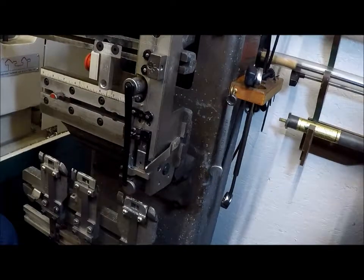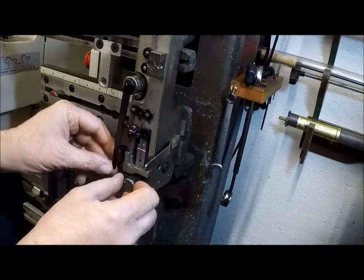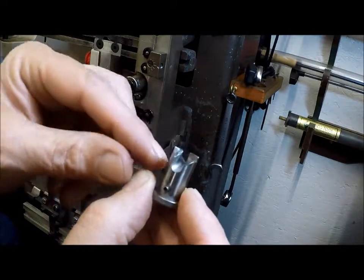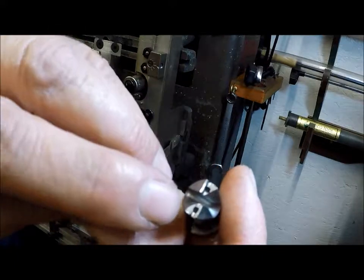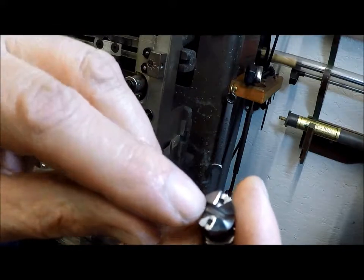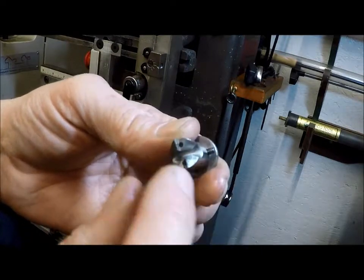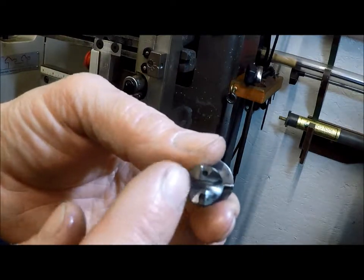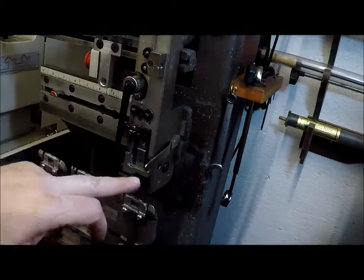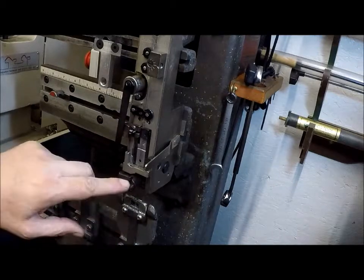To remove the swivel, you can just pull this to the side. Take this out, clean it, make sure it's in good shape — no dirt. Especially make sure on these little magnets here and here there's no little pieces of wire or dirt built up. If there is, a good thing to use is a brass toothbrush or just a plain toothbrush and clean this off. Wipe this down real good, make sure it's good and clean. Take a rag and a screwdriver and clean the hole out — make sure that's nice and clean.